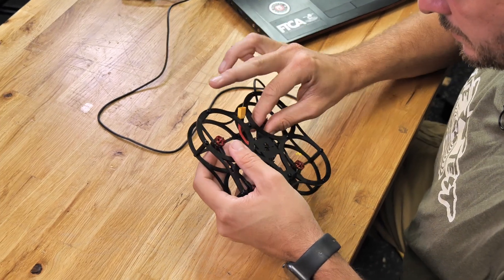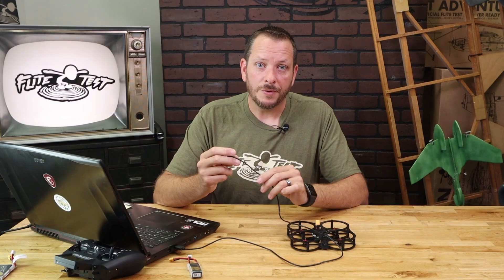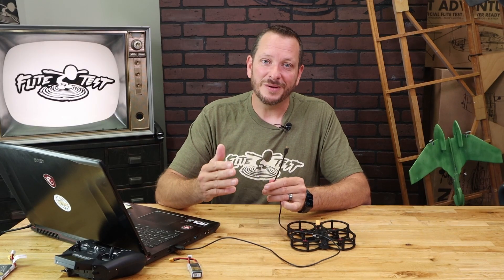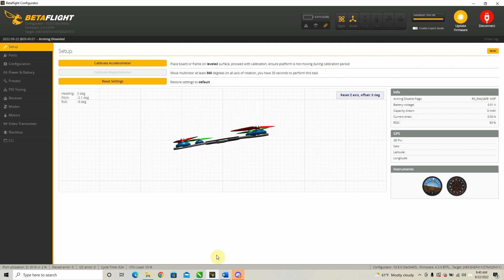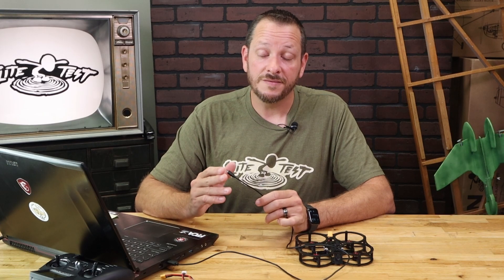For doing a proper update, you're first going to need your USB cable. Make sure it's not a charge-only cable, but one that has the ability to transfer data — if you're having problems communicating with your control board, that may be because of this cable. You're also going to need to download the Betaflight Configurator version 10.8.0. And the last thing is something called the ImmersionRC Driver Fixer. A lot of times computers will have difficulty connecting with configurator tools or doing firmware updates, and this driver fixer is a great tool to ensure seamless connection. All those links are in the description below and in our resources tab.